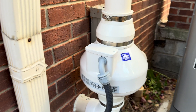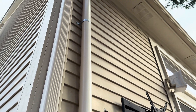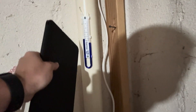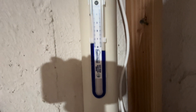On the outside of the house there's a fan — I'll show it in this video too. Right now there's a fan on the outside of my house and it's just running all the time. It's really low power and it's warrantied for 10 years of constant running, but the guy said it should last 15, maybe even 20 years sometimes. There's also this gauge with blue liquid — it kind of shows the airflow. What we want to see is that it's at about one half on the left side, which means there's positive airflow going through as it's supposed to.